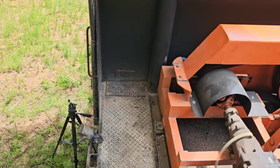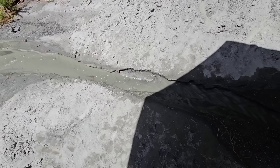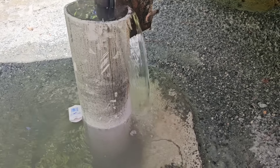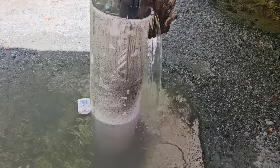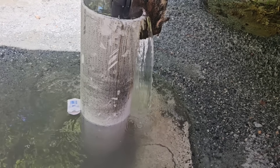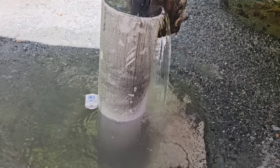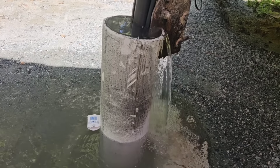It has been one hot day. The frack's all over, and it looks like we've got a considerable flow back — that is awesome. Right now we're not dumping any water into the well; this is just the water we pressurized into the vein down in the ground, and the vein is pushing the water back. That's not to say that's going to be the natural flow rate because it's under pressure, but under pressure it's still flowing probably six or eight gallons a minute. Impressive. The true test will be when they put a pump in this thing and try to use it like normal — see if they can drain it dry.